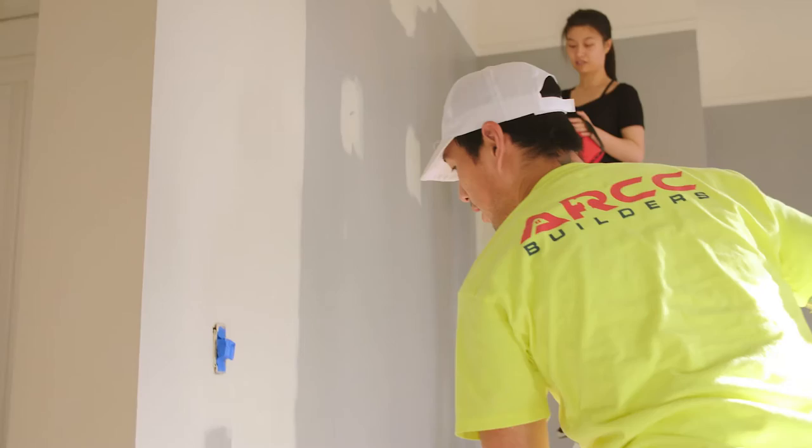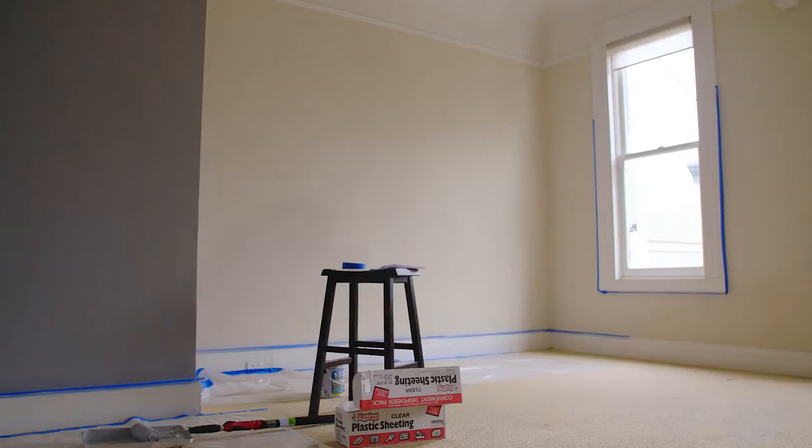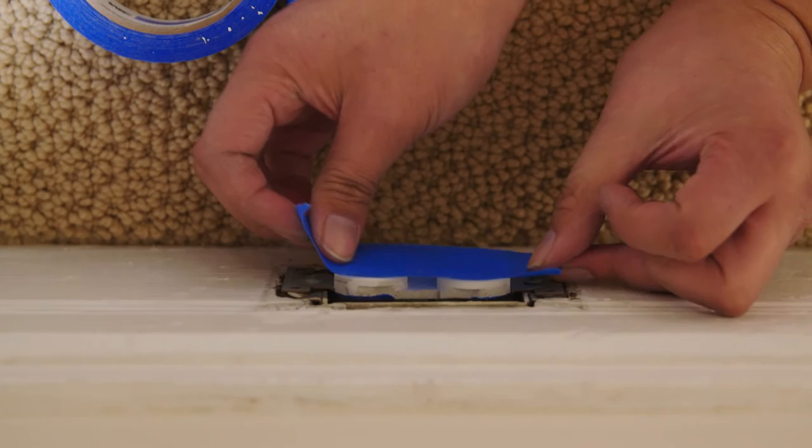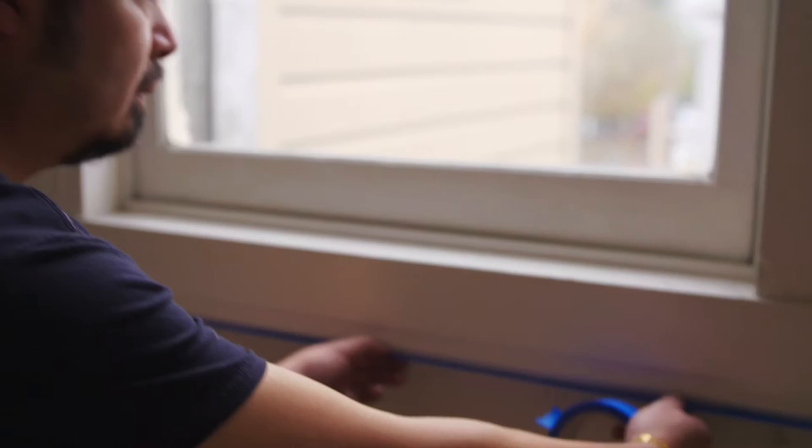Now let's prep our room for painting. Avoiding paint accidents is all about preparation — cover everything you don't want to get paint on. Move large pieces of furniture to the center of the room and drape with plastic. Dust cobwebs off the walls using a duster and then wipe them with a damp towel. Allow to dry completely. Remove all light fixtures and electrical outlet covers. Cover them with tape so that dust and paint can't get in. Apply painter's tape anywhere you want a straight edge — along baseboards, at connecting corners of walls, and where wall and ceiling meet.